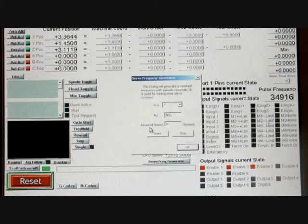The next box is reversal period. What this sets is: if we have a step speed of 500 Hz, we can actually step the motor one way for two seconds, then it will stop and reverse for two more seconds. So effectively, the motor on the X axis is moving 1,000 steps to the left and then 1,000 steps to the right after a two second pause. This will carry on until you stop the program. So if we enter two seconds and click start, you can hear in the background the X axis stepper motor running.